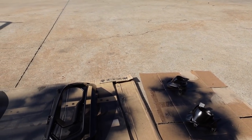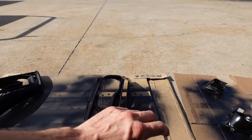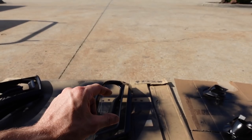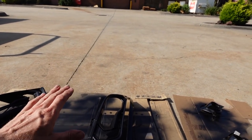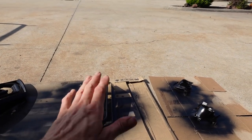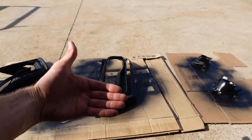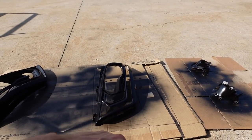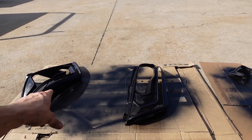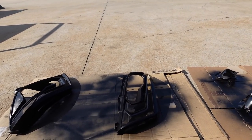Another bit of advice for painting: don't go too close with the spray can. Even if you're sweeping and doing an on-off motion, going too close risks runs because you're focusing on a spot too close. Keep about 30 centimetres between you and the part. Also grab the part from the underside and rotate it maybe 180 degrees from where you painted last time — that helps you see spots you haven't painted or may have missed. It actually helped me spot a missed bit on the underside.